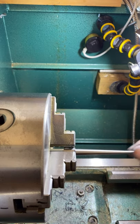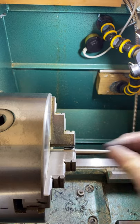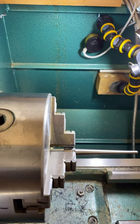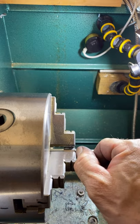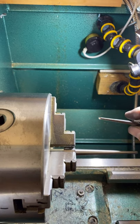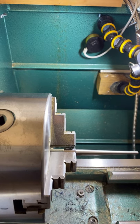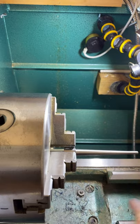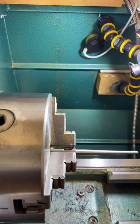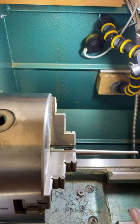So now the next step is we have to harden this. This is made out of oil-hardening O1 tool steel, which you harden by heating and then quenching in oil. Then we cut with a grinder half of this away to make it into that kind of a shape, like that. You do that on the grinder. So on the next video, I'm going to harden it, because that's kind of something that's an eye opener. And then we'll grind it, and then we'll be done.